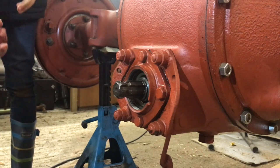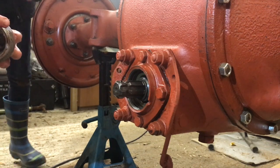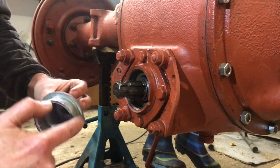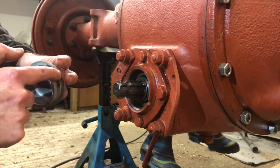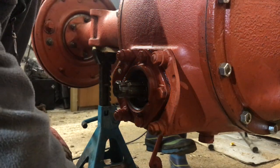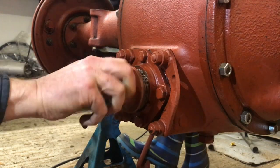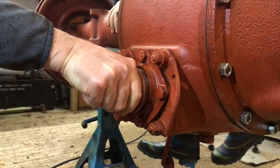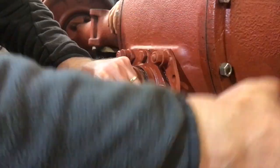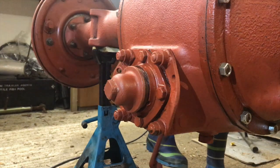Now, the cap really just goes on to protect the PTO shaft. It's not an essential component, but because we have one, we're going to put it on. We need to just grease these threads a little bit. Now, the cap is aluminium, so it's a soft metal, and this case obviously is steel, so you do need to be careful and not allow the threads to strip, because the threads on the cap will go first. Luckily the caps are cheap to replace, so that's not the end of the world, but that's it. Just a little nip just to hold it on, and that is basically it.